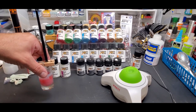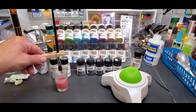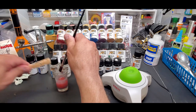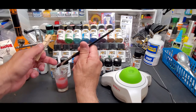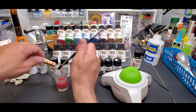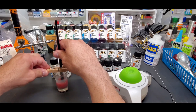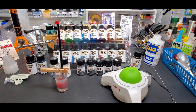Alright guys, it's been about 25 minutes. Don't forget the old trick: take your brushes, put them in lacquer thinner, and put them on a clothespin — don't let them sit in the bottom of the jar. A lot of times you end up with bent bristles because it's sitting with pressure on it. What you want to do is put it in the lacquer thinner, get a shot glass, put your clothespin, keeps it hanging up. It keeps the bristles perfectly straight and cleans it out.